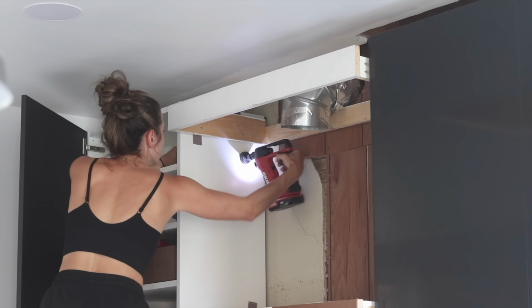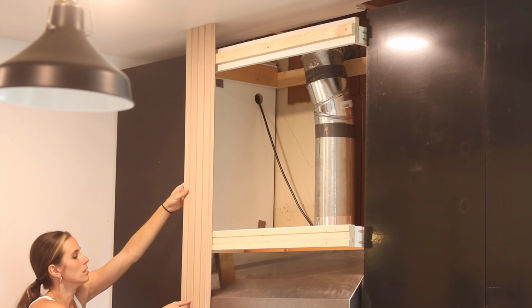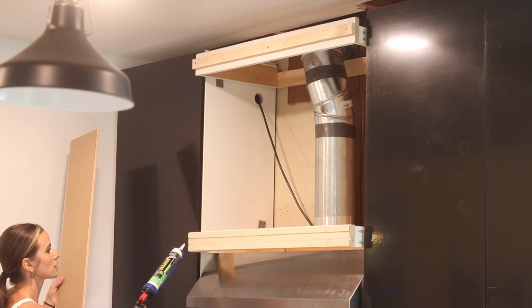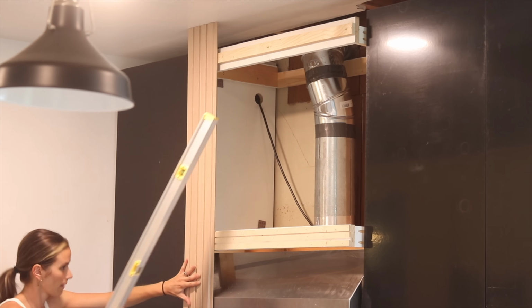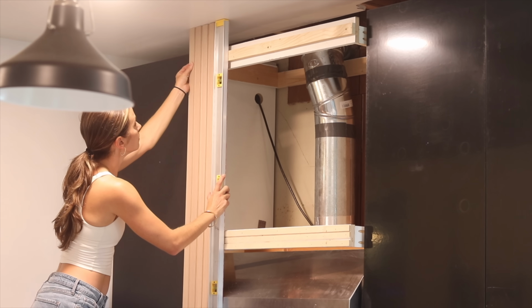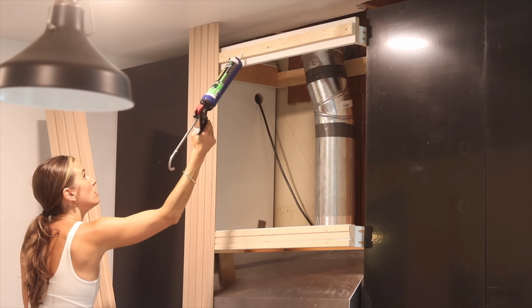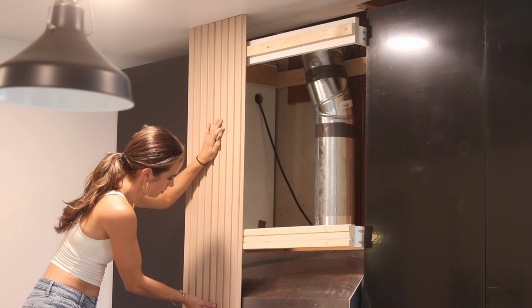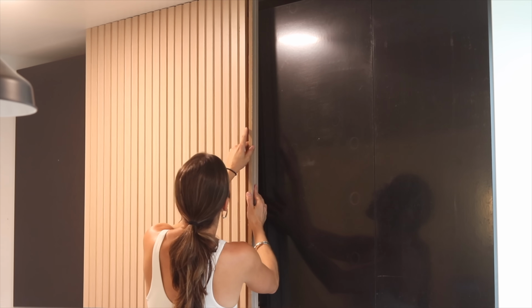But when I was done, I decided, number one, it looks a little too bulky and weird because my cabinets are so tall. If my cabinets were shorter and mounted higher on the ceiling, they would be less functional, but having a hood vent line up with them would have made more sense. The way I did it here, my cabinets are about 20 inches off the top of the counter, which is a more normal height for use, but inevitably I do need to move my hood vent higher because I found out there's clearances, especially of our gas range where there's open flame, and 20 inches is simply not enough.